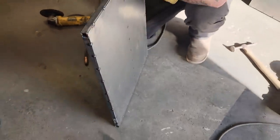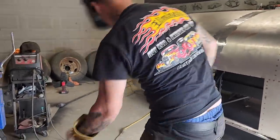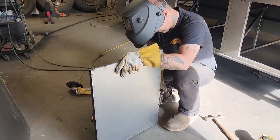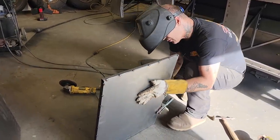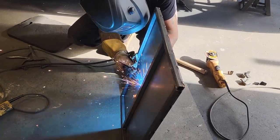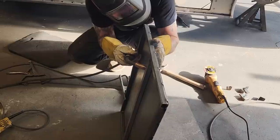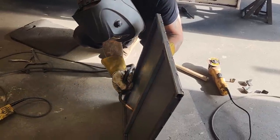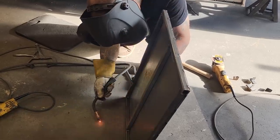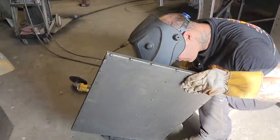Door feels really good. Did not do that on the other one. So that door will have to be welded all the way around the outside. If it is not, you have the chance of filler cracking. This looks good through the center. Put it right up the center first. Awesome. That's good. Now it says on the bottom what they are.